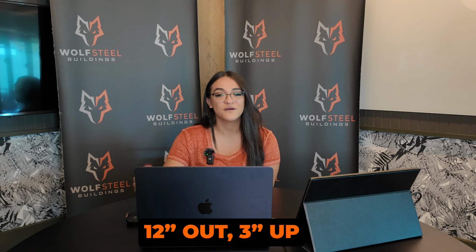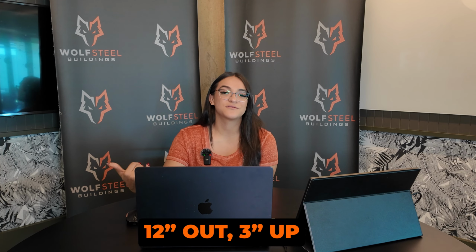Pitches can be calculated if it's something you're interested in when you're talking to the sales rep. If I were you, I would let them do the math, because if I didn't work in this industry, it would be a little hard for me to remember rise over run. But essentially when you're looking at peaks, for 3/12, for every 12 inches out, you're going 3 inches up. Same thing with your 4/12, every 12 inches out, 4 inches up, so on and so forth. So it's definitely something to keep in mind.